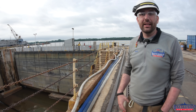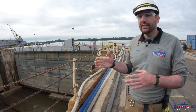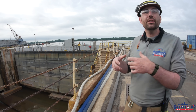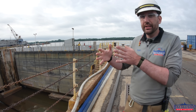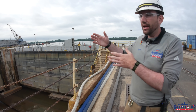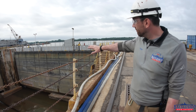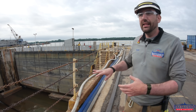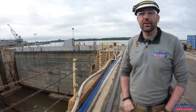Another interesting fact about the caisson that Danny told me is that it is two-sided — it's got an A side and a B side. So every dry docking, you could flip the caisson and it works just as fine each way, so that one side is in here dewatered so you can do maintenance work on it, and then the next time you do it the other way and do maintenance work on the opposite side.